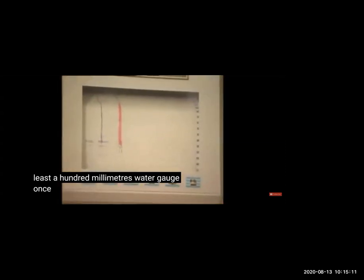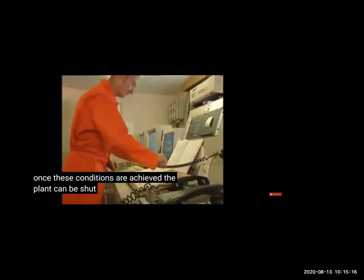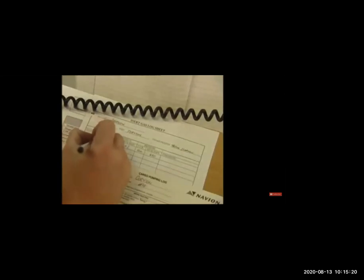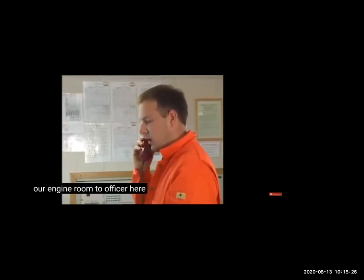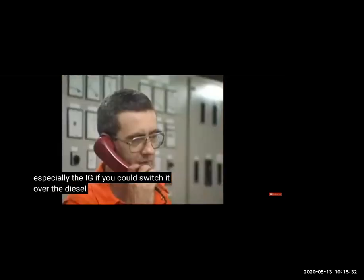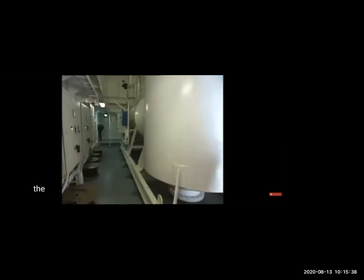And the vacuum side means minimum pressure should be 100 millimeters of water gauge. This is a very important thing, keep in mind. So high pressure is around 1800 or 2000 millimeter water gauge, and minimum is 100 mm water gauge, because we want to keep a positive atmosphere. We don't want air to enter at any time and create a flammable atmosphere. So minimum pressure in the tank should be at least 100 mm of water gauge, and maximum as per the design, 1800 or 2000.